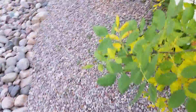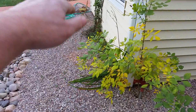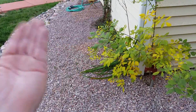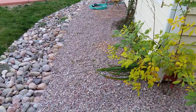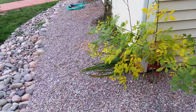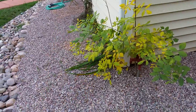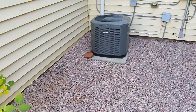There's a good amount of rock here. I didn't check every square inch, but there are enough low spots where I'd feel comfortable saying that this rock needs to be pulled back. All that rock needs to be pulled back — you'd probably put it over here temporarily, pull up that plastic, and get rid of it. Since we're so close to the siding, it'd be more of an issue of taking dirt out. That rock is all the way up against the bottom of the siding.